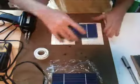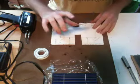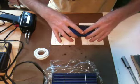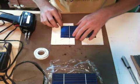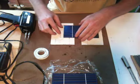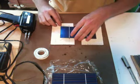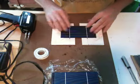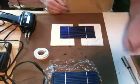The first process you need to do is add the electrical connections to the cell itself. These are really thin and they're easy to break, so I've been using this thing I made out of some mat board, which doesn't seem to fit all the cells because these are like a factory second grade, so they're not the best. Let me grab a different one just so it fits a little better. Okay, that fits. It just kind of holds it in place so you can grab onto it when you're working and keeps the cell from sliding.